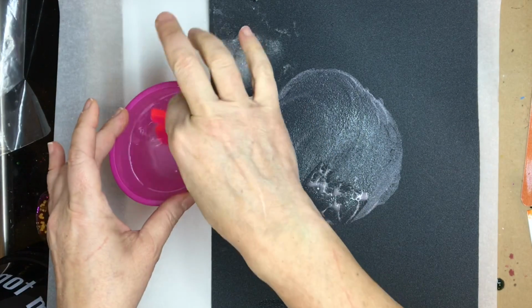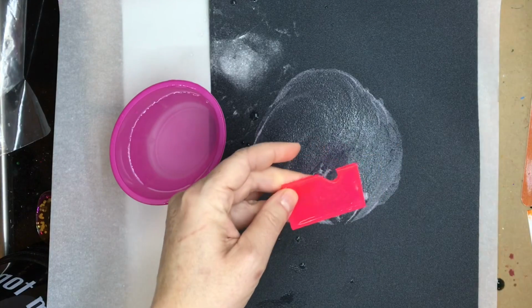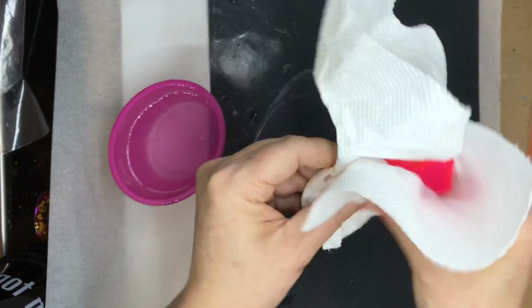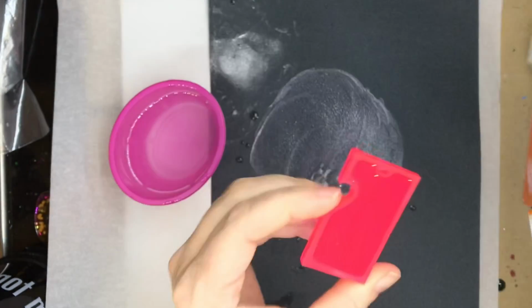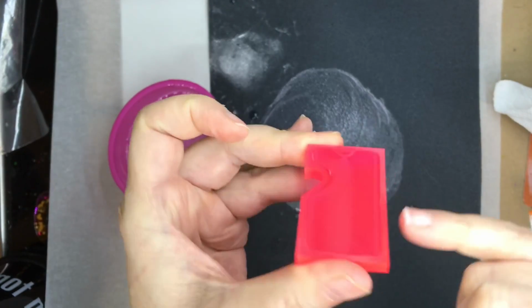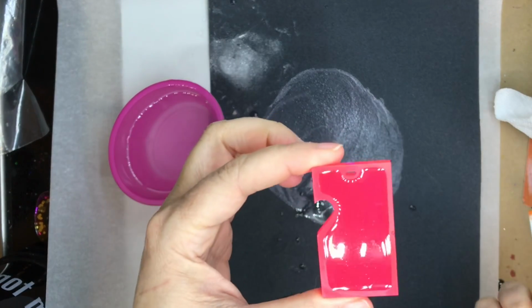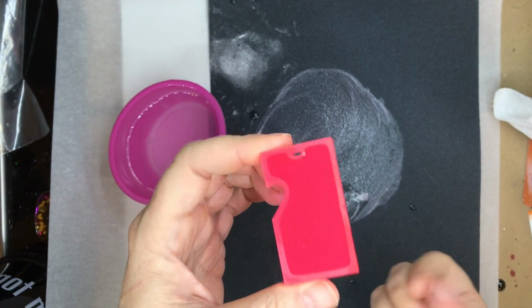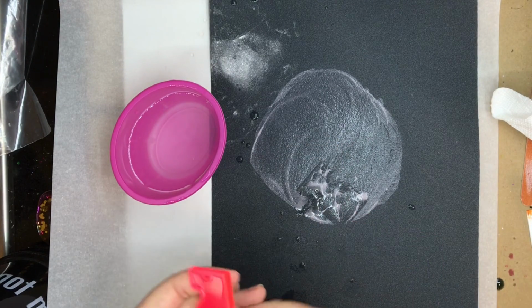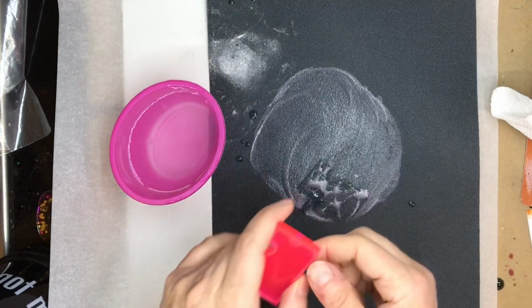So once you have your piece sanded, at least to the point where you're happy with it, let's take a look at this again. Let me dry this off. Then you start going down to the next lowest grit of sandpaper. So we'll look at this one. You can see here, we've taken off the edge. Okay, so no more sharp edge that we have to worry about somebody hurting themselves with. However, you can see it's kind of frosty here. Now, you might like that. You might think that's a pretty cool effect, and if this is where you want to stop, then that's great. Otherwise, you want to go to your next lowest grit of sandpaper, which in this case, because I started with a 150, I'd probably go down to a 400.